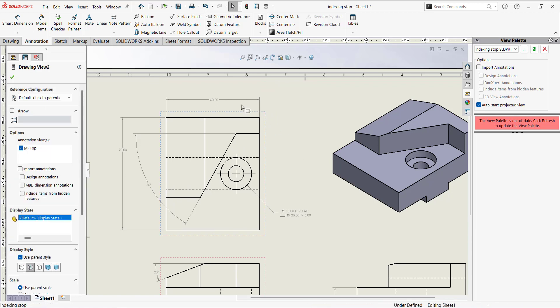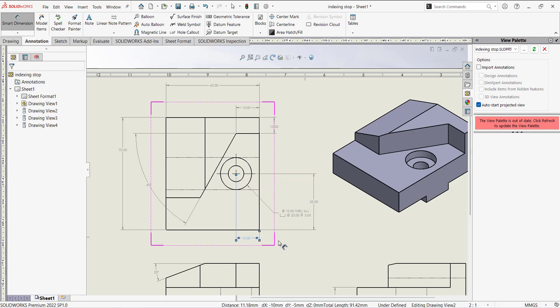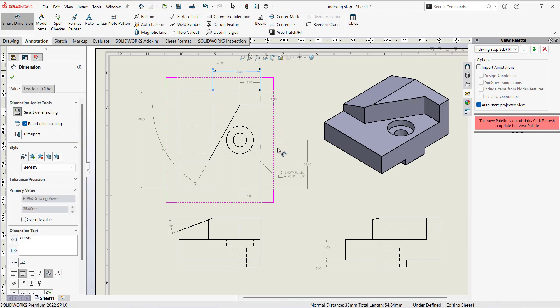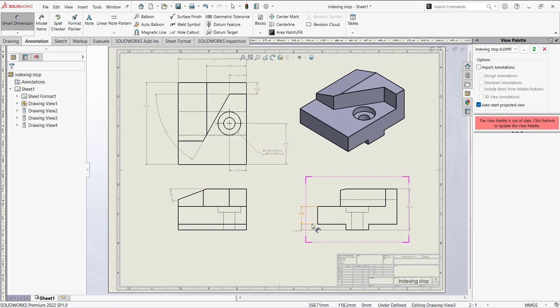Place the base of the triangle a little bit below, position this point like that, and dimension between this center point and this one. From this point to this quad this dimension is 35. Item 2 is now completed. We fully defined it, but check if any dimension is missing. From this point to this one, this dimension is 35. The drawing is also done — you can save it.